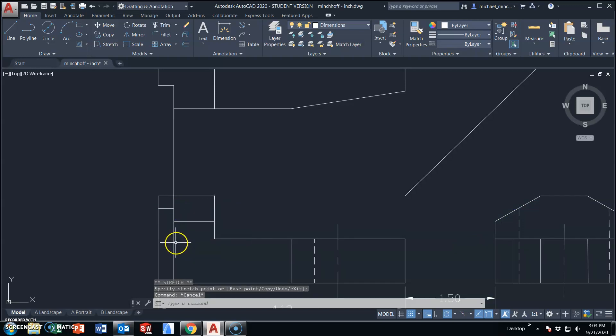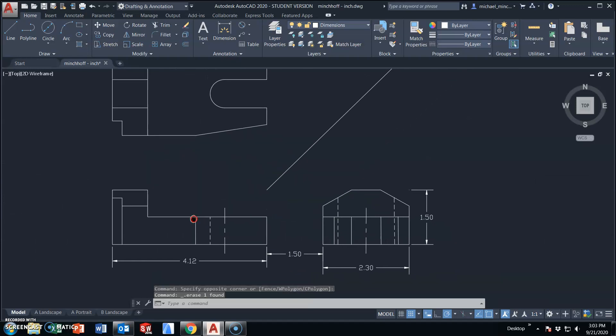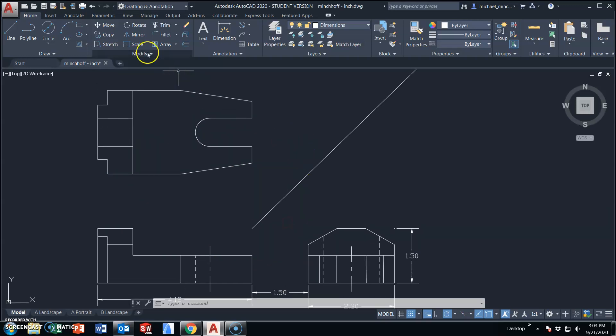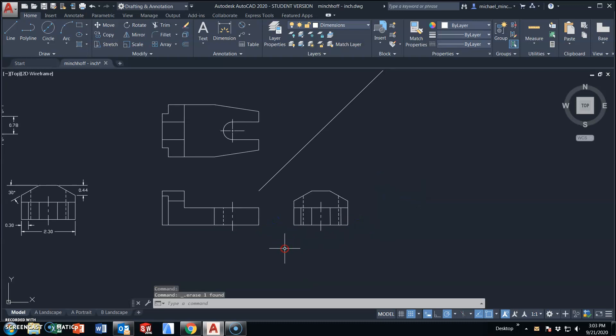So now it's just a matter of cleaning this up — this gets stretched back and this one gets stretched down. I have laid out and created all the construction for this one. I do need a center mark; it is under Annotate where you can type in your dynamic input center mark. I have created this center mark. We will be putting overall length, width, and height on here, but we'll be saving the dimensioning for the next video.